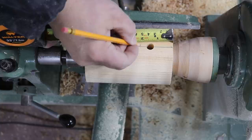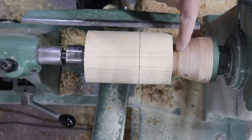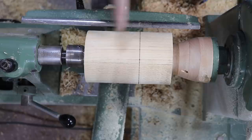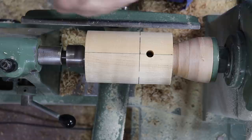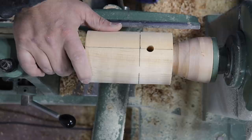The next step is to drill the two-inch hole. We're going to mark a two-inch line all the way around so we know where that is and know where we're starting from. We're going to cut this down — not smaller than this — and put some type of profile on here. The hardest cut to make in this whole thing is the ledge cut that goes from where the little roof starts on top of the birdhouse to the wall. That's the one where you're cutting cross-grain. This is pine, which is soft, so it's probably one of the hardest ones to get a clean cut on. You can make this out of anything you want — laminated walnut, maple, cherry, purple heart — and make them even more fancy instead of just two pieces of pine.